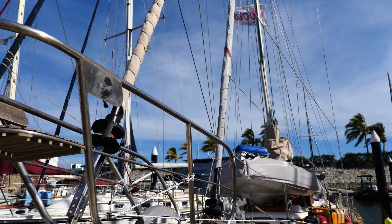I don't think I'll take off the whole sail. I'm just going to put a halyard on it and support it, and remove this pin and replace it likely, and just make sure it's all good for a crossing. Don't want to break a gooseneck when we're trying to, you know, cross the Pacific.